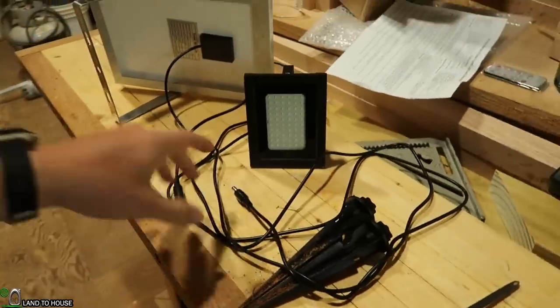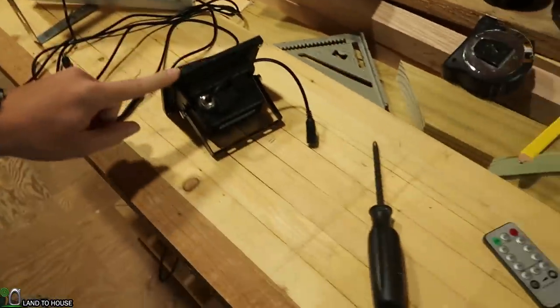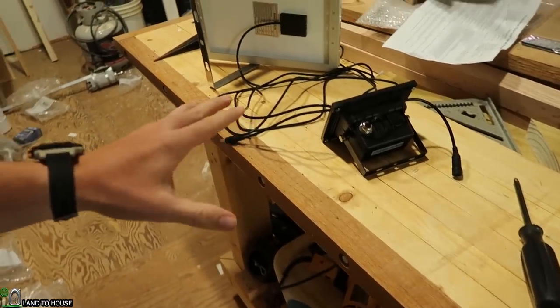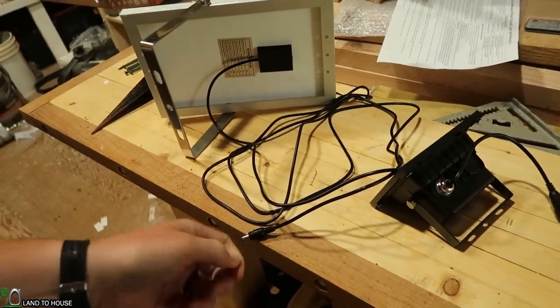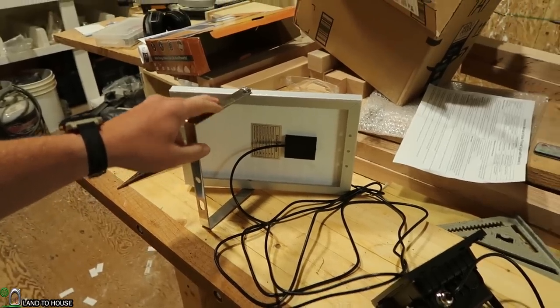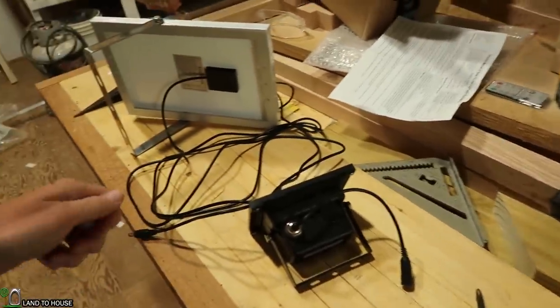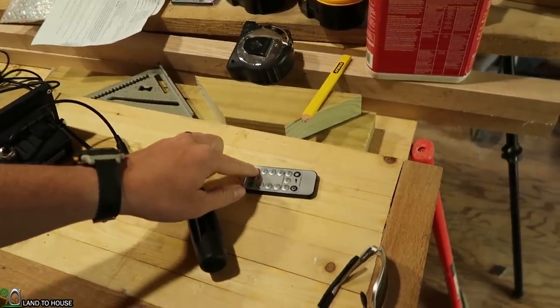Next day — I just wrapped up a quick review of a solar light from Bonner Technologies, and I want to use this light in the playhouse whenever I get that built. So basically, if the solar panel is receiving sun, it is charging the unit and it won't turn on. But what I can do in the future, when it's in the playhouse, is hit the on and auto button and then put an inline switch in the cord. Bring that down and around to the front door of the playhouse so the kids can just flip that switch, and it will turn off the charging capabilities to the light. Of course, that will interrupt charging, but if I turn that switch on and then off, it will allow it to charge. Sounds complicated, but it won't be.